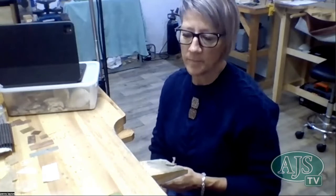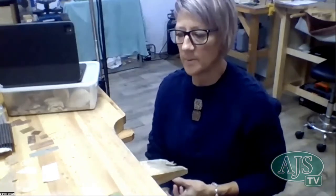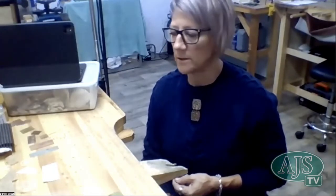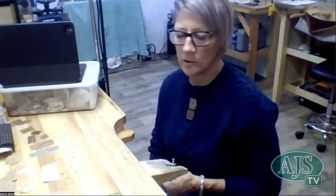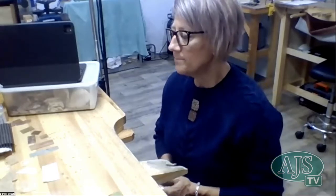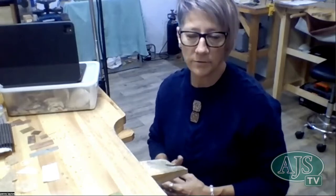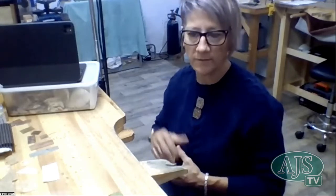And it does take a little bit of practice to know how much pressure to apply. So it is just like anything when we're making jewelry, it is just a process of keep practicing and experimenting. So I guess make sure that you practice with your base metals. Don't go using all your expensive metal to do any of your experimenting. Use some copper or some brass. Both of those metals are more than fine to use. And make sure that you anneal any of your metals as well, so that you're not putting anything too hard through the mill, or you're having to turn the mill up so hard for it to go through.